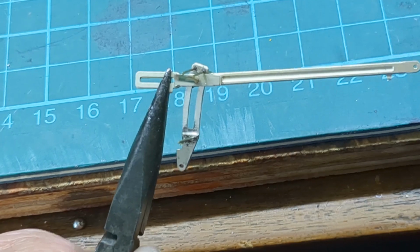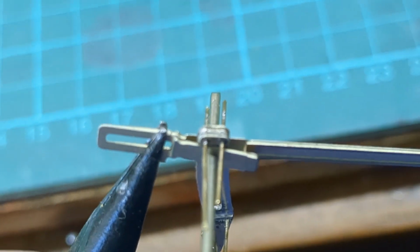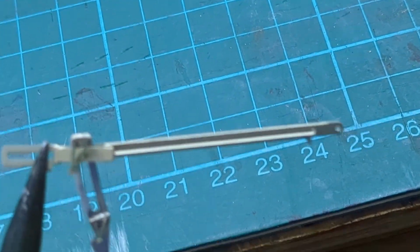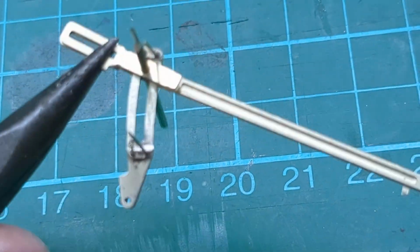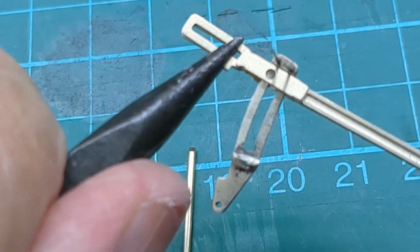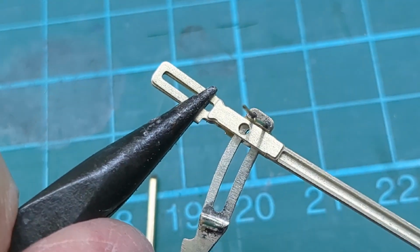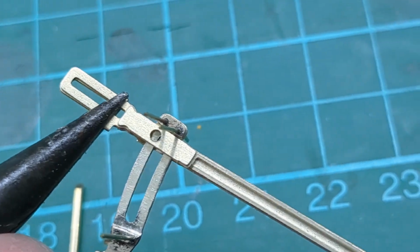The next thing I've got to achieve, these two pieces here, is where the pliers are, that goes into the lifting link. There's a piece of 0.45 wire, and as you can see, hang on, I don't know if I can do it. Sorry, it's come out. It slides up and down in this expansion link in that slot. So I've got to solder this together now and put that rod in and just solder it on the outside, making sure it doesn't gum up anything.